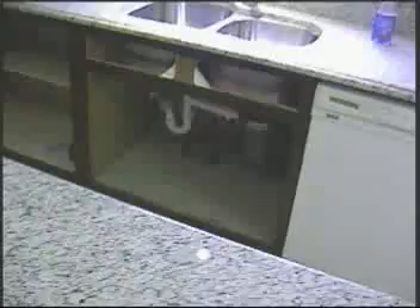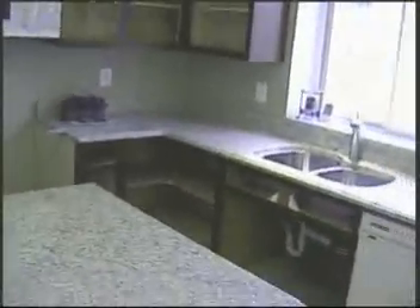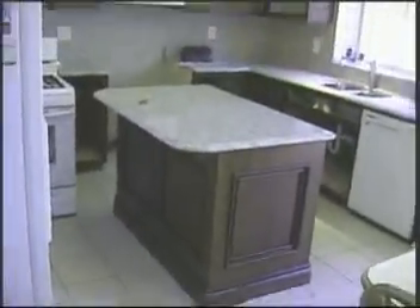This is the bottom of the sink base — sink bases get damaged over the years. This is a particle board, basically raw particle board. We use a plastic melamine called a mica board on the inside of our new cabinets. It's a laminated board that we purchase pre-laminated and it's great as a moisture barrier.